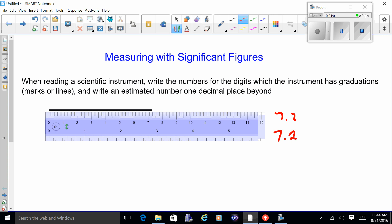You write down the numbers you know: the seven is right, the seven point two is right, and then you estimate one beyond. Some people might even say it's seven point three zero, because it looks like it's right on the three mark — any of those are fine.